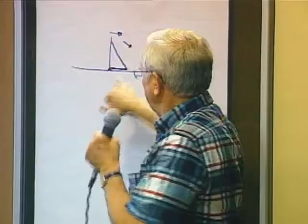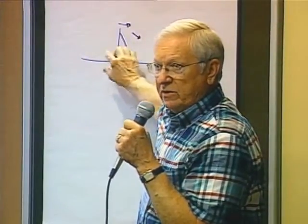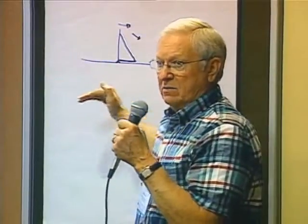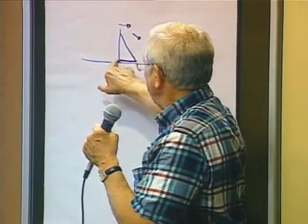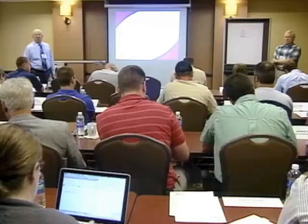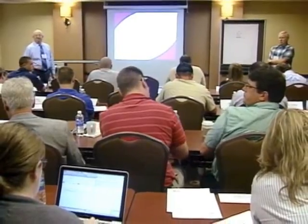You're an engineer. There's no real air gap here. I just did that to illustrate that it kisses but is not bonded. You bond here, and you do have a little fillet here, a little fillet on the backside. You will need something underneath as you're applying it to your gusset, some kind of a spacer or shim underneath the gusset itself.